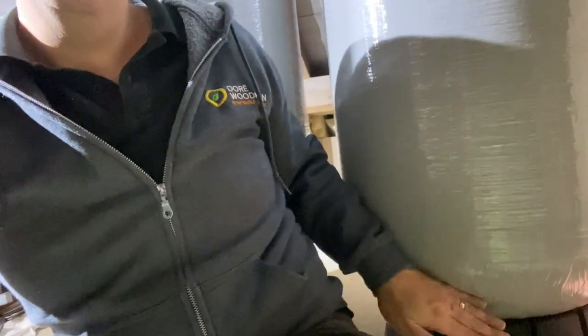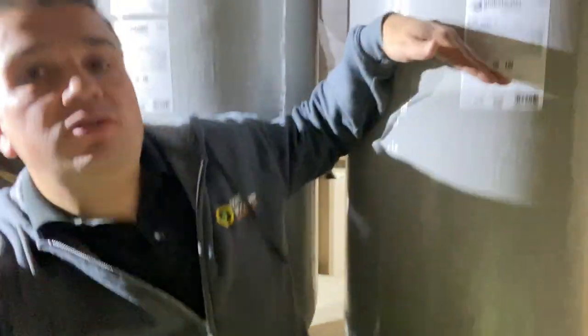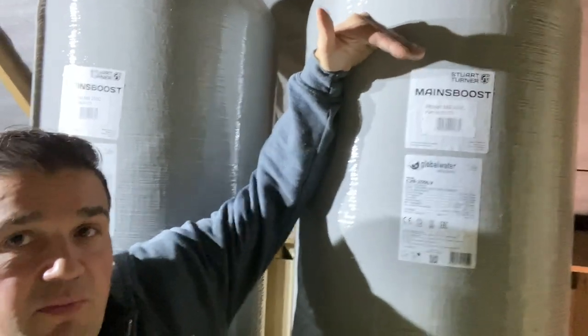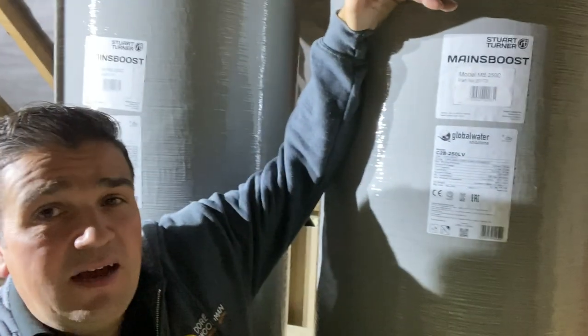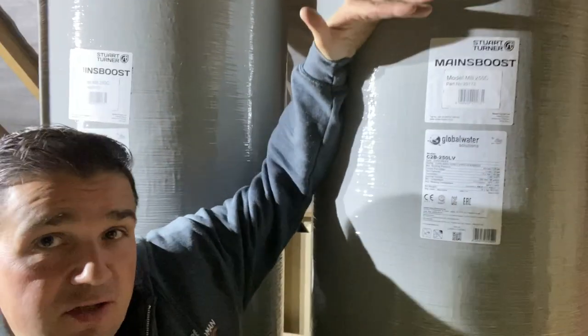They've got a membrane down the bottom here. They start to fill the reservoir with water, and this diaphragm starts to stretch, so it has a good amount of pressure behind it. Once these are up to a certain point, when you start opening outlets to showers, baths, kitchen tap, whatever, this will start to push that down, so that when you open multiple outlets, nothing's diminished in the flow rates and the pressure behind it, which is perfect, exactly what we want.